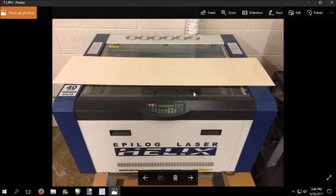We have to put some veneers together and cut them. Here's the problem: the veneer starts as a 10 by 40 sheet, and we cut everything out of it so it goes on your board. But this 40-inch sheet does not fit in my laser engraver — the engraver only fits boards that are 24 inches or less in length. So I'm going to give you two methods to solve that problem. You choose whichever one you like; they both work just fine, and I'll give you the pros and cons of both.